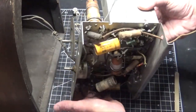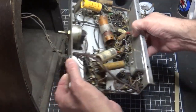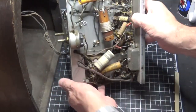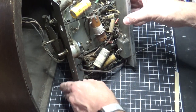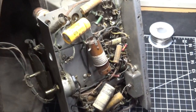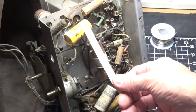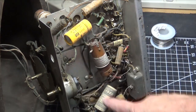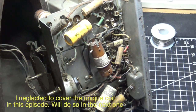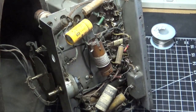This is a very simple set, so we don't expect there to be a lot of things in here. We want to be really careful that we don't damage that dial pointer. Looking at the bottom, we know we have a pair of eight microfarad caps — here's one, here's the other. We have a coil mounted underneath with something unique about it that I'll show you in a moment. We also have a ballast resistor right here and a handful of wax caps. There's not a lot happening in this radio.